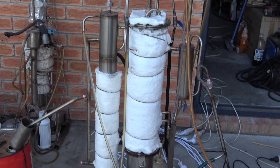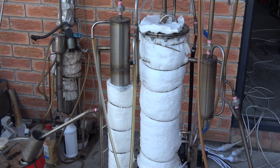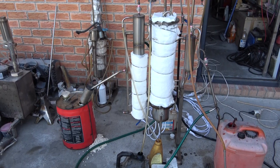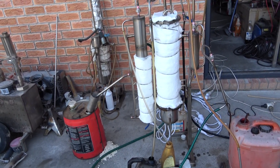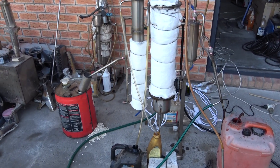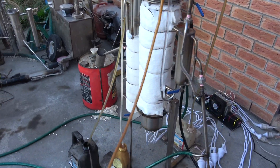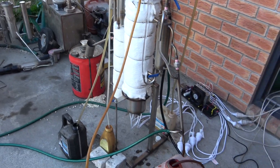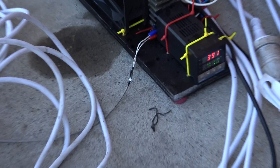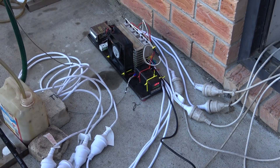You can hear some water droplet explosions. Just the day before yesterday I was distilling some good transmission fluids, and today to test the unit I collected all the oils and whatever leftovers I had. Of course there's some water in there. Currently running at 390, 391, 392 degrees — temperature going up with every explosion.